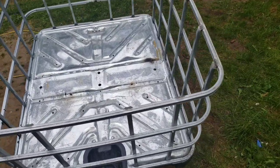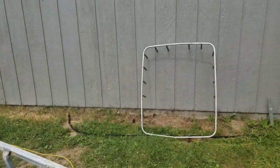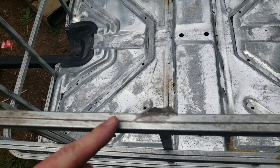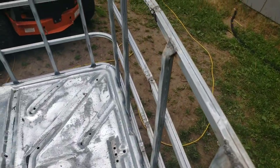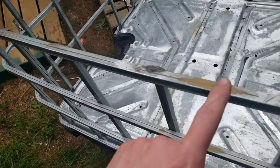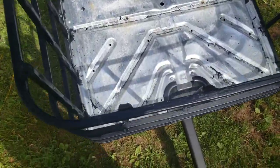I went a slightly different route with plugging up the square tubes. What I did is cut off the top layer, then took the square tubes and spread them open with a screwdriver and hammer, then bashed them in as close as I could and welded them up best I could without burning holes through. Now I did some grinding to clean it all up, make it nice and smooth, and then painted it.